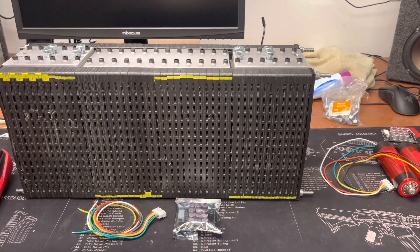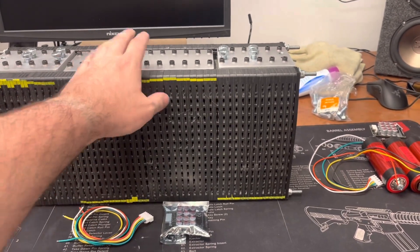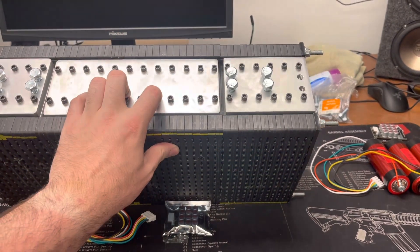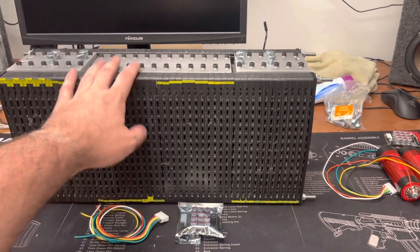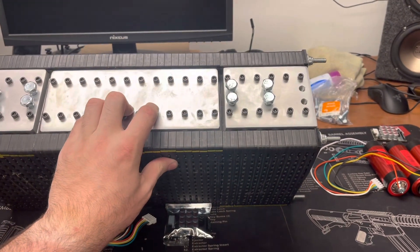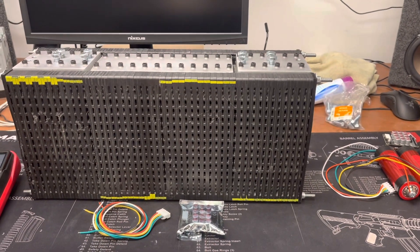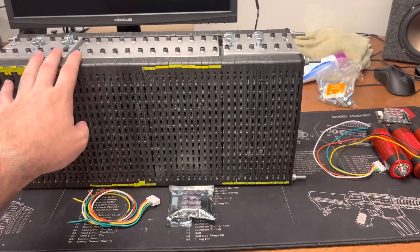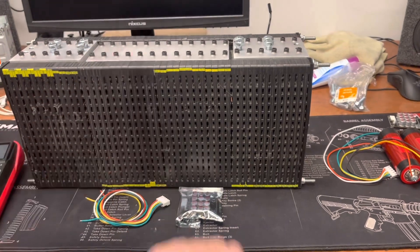It's 200 holes, and then 200 deburring. It was like three hours of drill press. And then I spent like two hours sanding these down with an orbital sander down to 600 grit. I don't want them polished, but I wanted them a clean look. There's a ton of markings on them from the metal yard. 6061 aluminum - those are good to go.